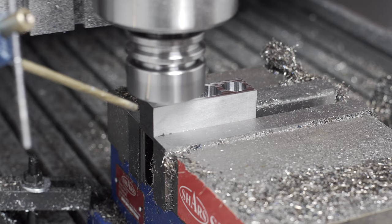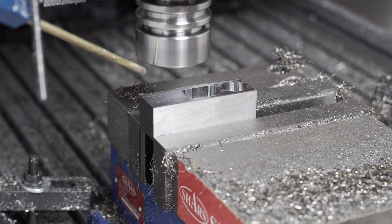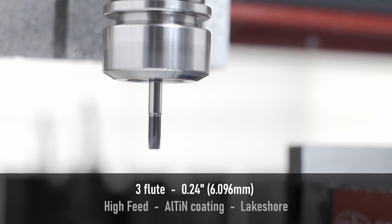I'd love to blame this on conventional, but I think this is a programming mistake. This bar is just roughly cut on the bandsaw, and in Fusion I didn't add any extra tolerances on the stock. Basically, the end mill met a lot more material than I was expecting. But the show must go on, and I had another end mill I want to test.